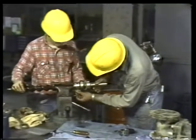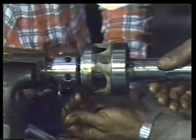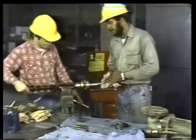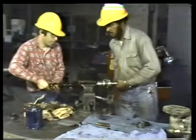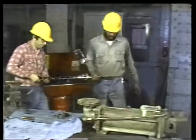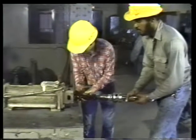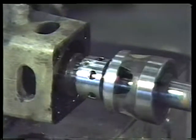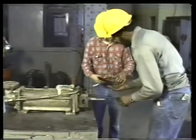When all the set screws have been tightened, the rotor is completely reassembled and ready to be installed in the pump. Loosen the jaws of the vise and lift the rotor out. Again, be careful not to bump the rotor against the lip of the casing. Guide the rotor in gently, turning it, if necessary, to help it mesh with the idlers inside. Complete the job by installing the end plate.